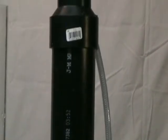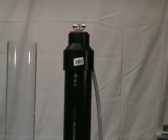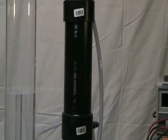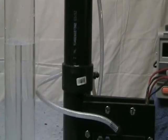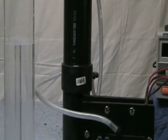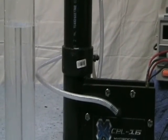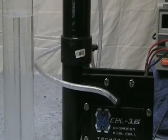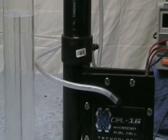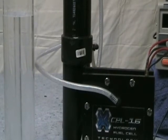Before putting the bottle in the HHometer, here's a recap of my setup. There's my bubbler — ABS four-inch — with gas out, gas in, and cell recirculation at the base. This is a closed system: hydrogen circulates out the front into the base of the bubbler, and another fitting in the back recirculates the hydrogen/KOH electrolyte back to the cell, helping it run cooler and more efficiently.